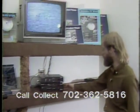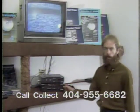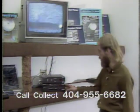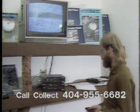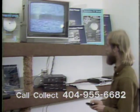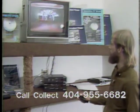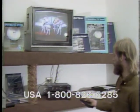Since I know the system is tracking, I'm going to choose a channel which is easily recognized on SATCOM 3, because I want to find SATCOM 3. I choose 11. It's MTV. It's very easily recognizable. And I go east and west. I will go eastward because I know that I am slightly east of SATCOM 3. Okay, I move the actuator control until I find SATCOM 3. Okay, I now have pictures for SATCOM 3.